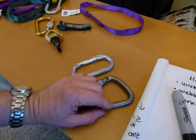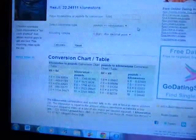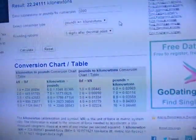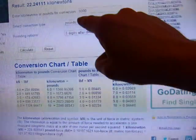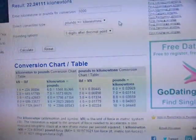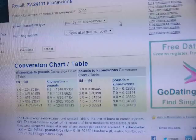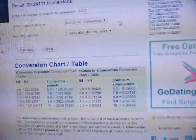What is 45 kilonewtons? Let's look at the converter. I typed in 5,000 pounds converted to kilonewtons — it's 22.2 kilonewtons. So the rock climbing carabiner at 18 kilonewtons doesn't meet fall arrest requirements for construction use — 22.2 kN is the minimum. It's perfectly fine for rock climbing, but not construction.